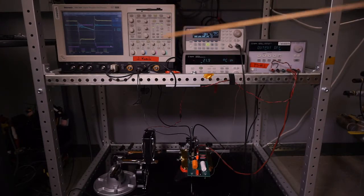Following six hours of testing, the device is removed from the circuit and statically characterized. Blocking voltage, transfer characteristics, threshold voltage, output characteristics, leakage current, on resistance, and capacitance values are measured or extracted.